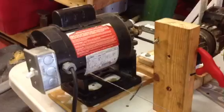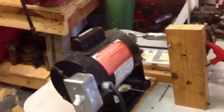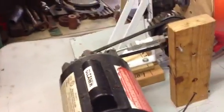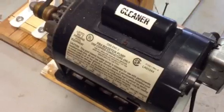that's my old pool pump motor. We replaced it because the pump went bad in it, front bearing went bad, and the result was I held on to it because I'm a pack rat, but at any rate, I pulled it apart and replaced the front bearing, which happened to be the same bearing that goes on General Motors alternators, so I was able to pick it up for like $6. And I took that motor, and there's the brass pulley that I made and the steel pulley that I made.